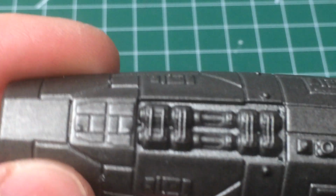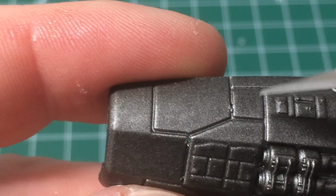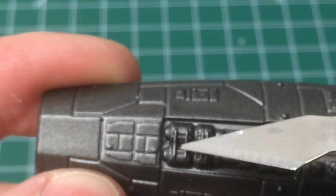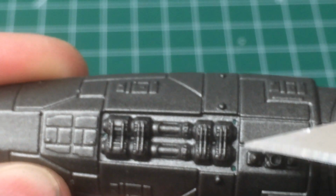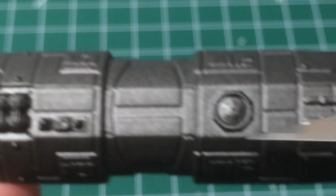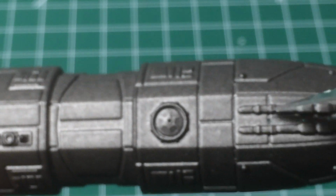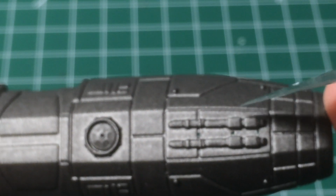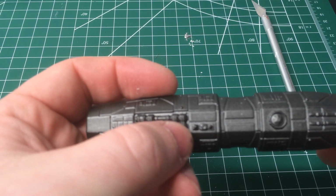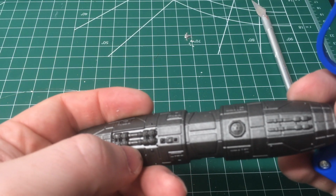And I've drilled a series of holes. There's several in it. These ones back here are just for ambient light. The 3 in here are for fiber optic. We're going to open this up. That guy's fiber optic, and 2 of these 3 are fiber optic. Those holes are 0.55 millimeter to allow the 0.5 millimeter fiber optic strands to go through.